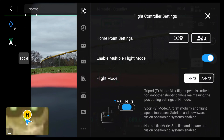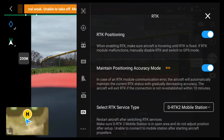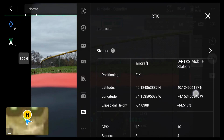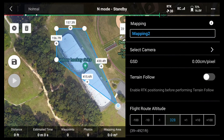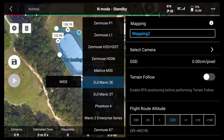Next we have to make sure we have RTK enabled. Press the three dots on the top right of the screen and make sure RTK positioning is toggled on. Scroll down and confirm you are connected to the DJI DRTK2, and if you aren't, click on it and connect. Next, create your mapping mission and set the area of interest on the screen. Once complete, select the DJI Mavic 3E from the list, select the wide camera option, and set the flight parameters as necessary.